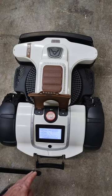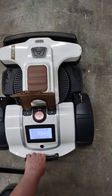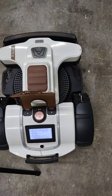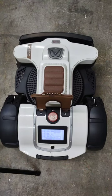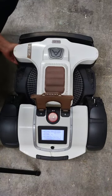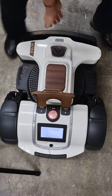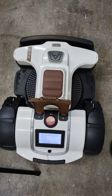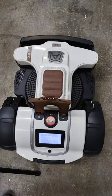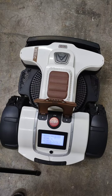But for winter service checking, you just lift it up and verify that if you tilt it around 30 degrees, it actually registers the tilt. It is wise to do it in all directions — so there, it got 32 degrees, and going around another direction it read 37. Lifting it up the other way got about 25, so it's clearly working. You can assess whether the two degrees offset would be a problem for the particular property. This particular robot is on a flat property, so I'm just not going to worry about recalibrating that small amount at all.